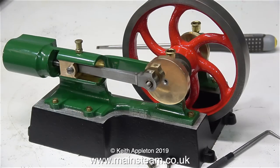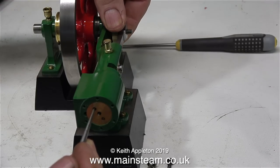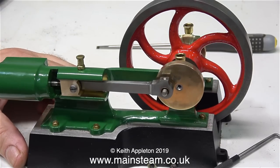One important job I need to do: the piston rod is only a temporary one because I wasn't sure how long it was going to be. In this clip I'm temporarily fitting the piston, and with the piston in the correct position I want to make sure that when I rotate the crankshaft it doesn't bind at the other end. The good news is it doesn't, but have a close look at the piston rod and you will see that some of the thread is exposed because it's too long.